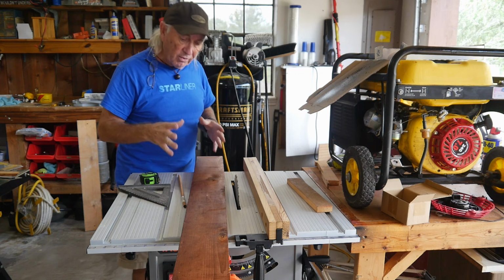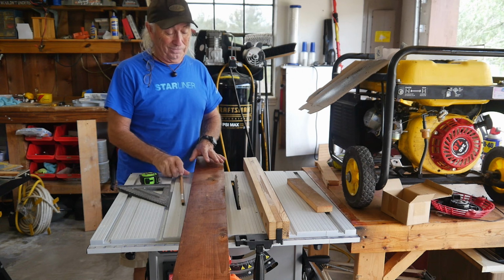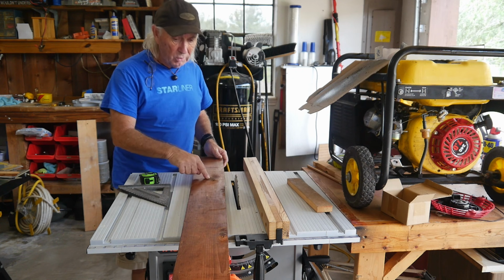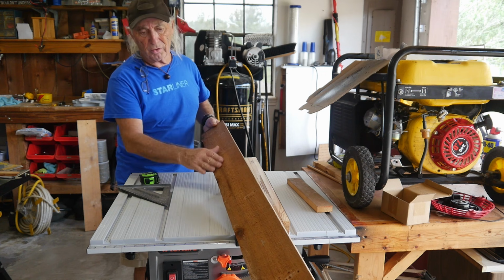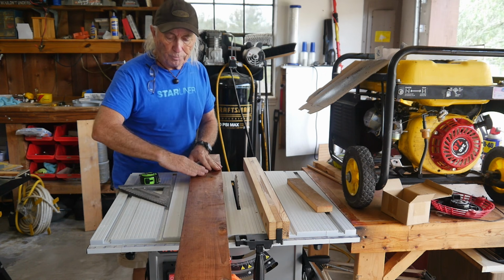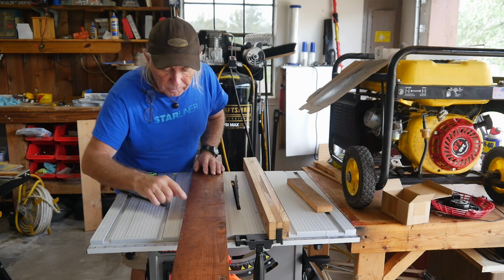Right now, I need 25 and a half inches of good lumber out of this lovely old board we got here. So, what I'm going to do is, I'm looking at that, don't want it. No, got knots. I'd like a fairly clear piece. This is rough on one side. It's like that, it's an old board. But I can run the planer just gently over the top of this and clean it up. And I think it should look pretty good.